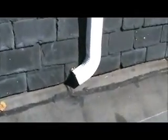problem areas around here where water could be coming in, backing up in this area here. I have looked at the torch down here that goes along this wall where the slate is. Does not look like the torch down goes up far enough under the slate. Maybe running down the slate and catching the edge of this torch down. Also up above it here, as you can see, the flange here is a little open at the bottoms, where water could be getting in along this area here. As you can see, the metal work here could be replaced and the metal brought down farther.